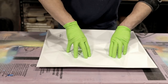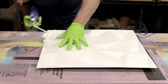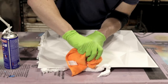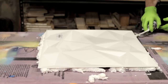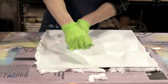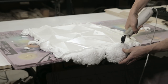I had been wanting to use some cheap 3D PVC tile as a concrete form for a while, but its flimsiness was a challenge. I ended up figuring out you could use Great Stuff, or here I'm using Loctite's insulating spray foam which costs a few bucks a can, and spray it underneath the PVC tile to support it. The foam expands and becomes fairly strong — strong enough to support a thin tile — and it worked really well. I'll put some links to the tile and the foam in the description.